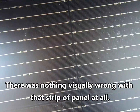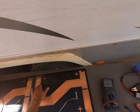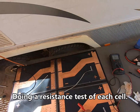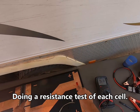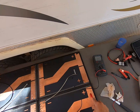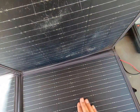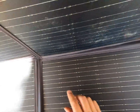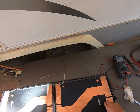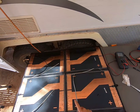That one there looks like it's burnt through actually. Measuring resistance across the suspect cell — it's about nearly a megaohm, one and a half megaohms, two megaohms — open circuit. So bottom line: despite visual inspection, there's something in here that's gone open circuit. And because these are all wired up in series, it means if one goes open circuit the whole thing goes open circuit. Which means, while we may not be able to fix this faulty cell, what we can do is simply bypass it.